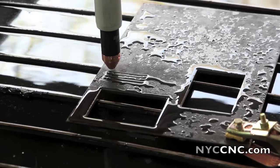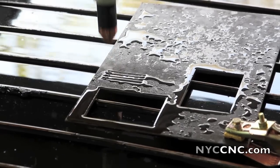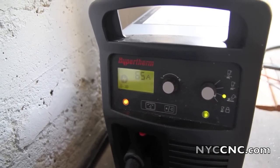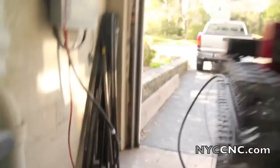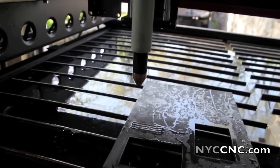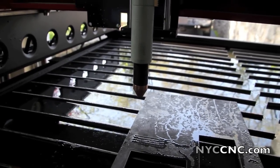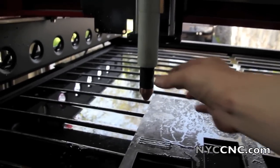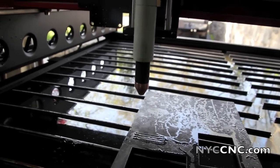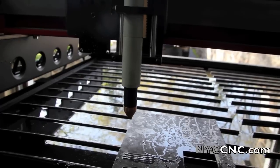Okay, misfire — that's a first. Let me take a look. Fault code 0-30. Before I even looked that up, I checked my consumables, and even though earlier I said they just had to be finger tight, they had loosened somehow. That black piece had unthreaded itself and was too far down. I'm quite certain that at least contributed to the problem, if it wasn't the whole problem. So let's start over.